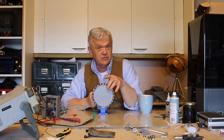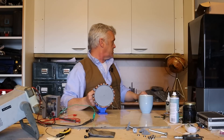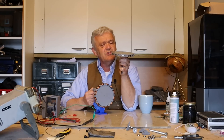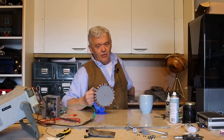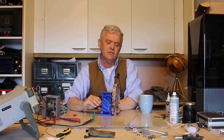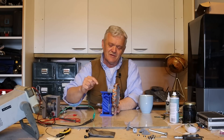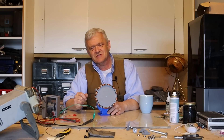This is pretty much standard for what we do, so if you've been watching the videos you'll know exactly what this is. It's just a disc with some magnets — neodymium magnets, one centimeter diameter, two millimeters deep — ranged around the center of the disc, and then around that we have a serpentine coil. Now we can spin that using our drive because we can back-drive it, and we get 10 times the speed out of here than we're inputting. So this thing spins like Billy-O.